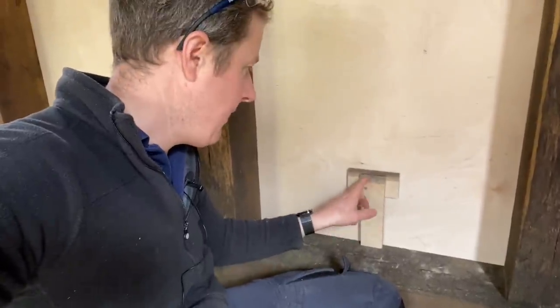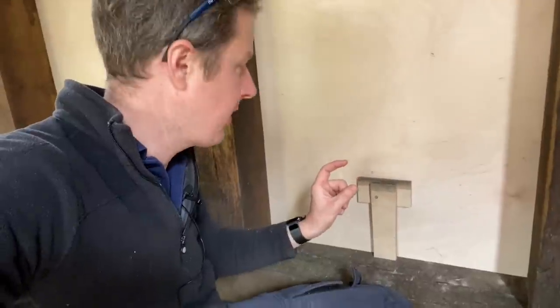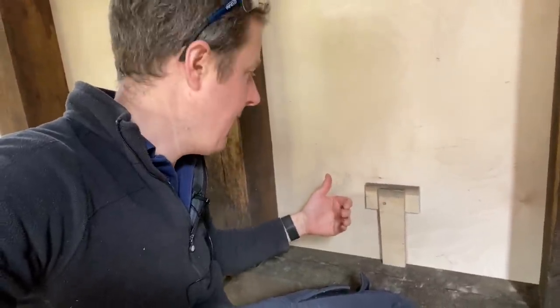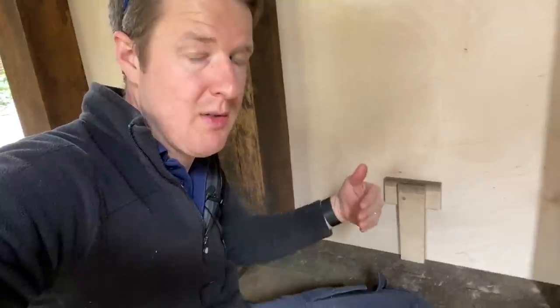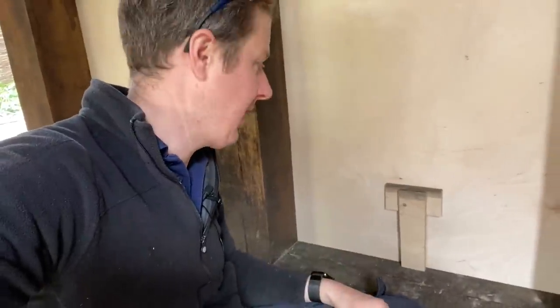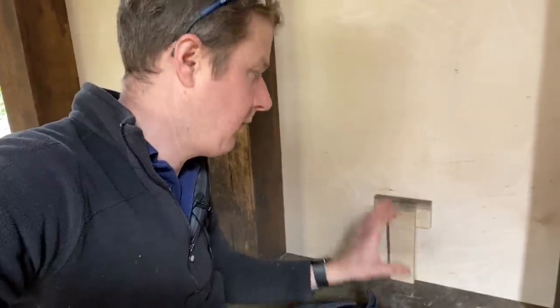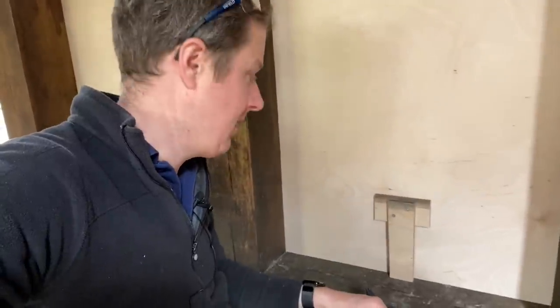The jig that I made is slightly smaller than a normal metal back box, because the idea is that the back box can't go through the wood. It only needs to rest on the back of the wood because of the cable entries and stuff like that. Otherwise it goes through the wood, we won't be able to get the armoured cable glands in. And he wants the holes to be as small as possible to avoid any gaps or anything like that when it's finished.